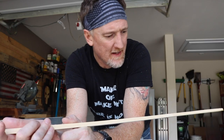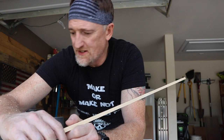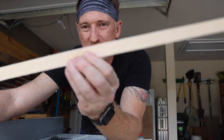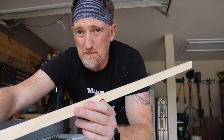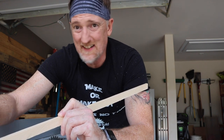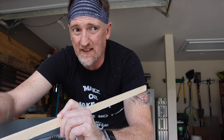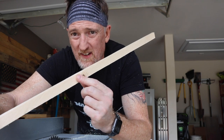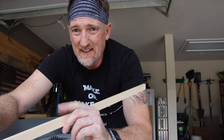The camera wasn't running when this happened, but I just had - I actually got two of them on here. One of the scariest non-scary things you can have happen when you're resawing on a table saw: you see this knot in here? That's a loose piece of wood inside a closed space. When you finish cutting through that part of the knot, the whole thing will pop because you just freed up a little piece of wood. Since it's contained, it doesn't go anywhere. But I wish I had the camera running because I jumped - it makes you think something went wrong and you have to immediately shut everything off. So just keep an eye on it; if you have little knots on the edge of wood when you're resawing, just be prepared for something like that to happen. It's really not super dangerous, but it's kind of horrifying.